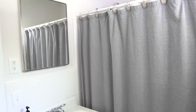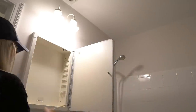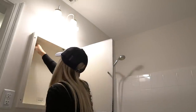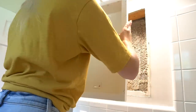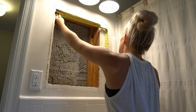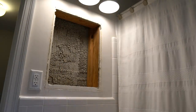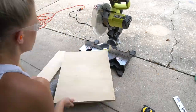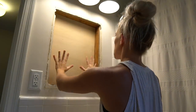First I want to show you what the medicine cabinet looked like before, and then we'll get started. To remove the old medicine cabinet, I'm unscrewing it from the studs in the wall. You may also need to take a utility knife and score the caulk around the cabinet so that it comes off the wall easier. Next I'm taking measurements of the opening — height and width — and subtracting a quarter inch from each so my new cabinet has room to fit and to level out. For the back of the cabinet I'm using three-quarter inch plywood, and I made sure it fit before cutting the rest of the framing pieces.